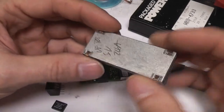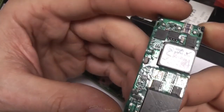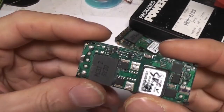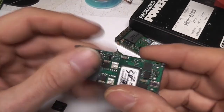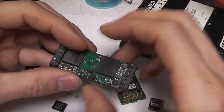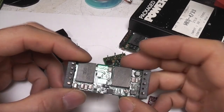This one has a metal plate for clamping to a heat sink, but they more commonly come with just a bare board, designed to be run in forced airflow inside fan-cooled equipment. I've occasionally used these in installations with quite a large number of LEDs needing power, particularly over a distance - addressable LED tape that needs a 5 volt supply can't really run over any serious length of cable without a serious voltage drop. I've got an upcoming job using over 400 metres of white addressable tape, about 100 blocks with converters like this powered from 48 volts over about a 20 metre cable run.